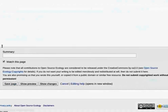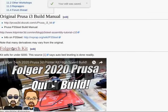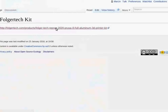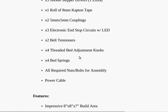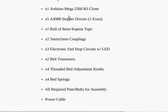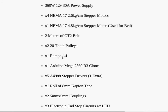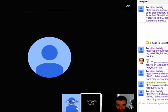So is it a requirement, or is this automatically taken care of, that you don't need to reprogram the firmware? I'm not familiar with the tool chains enough. There's the program on the printer itself, and that's what you need to change, but also things like configuration files. There is a configuration file for the firmware, and then there are different configuration files for slicing. So you would need to change the firmware configuration, but you can keep all your G-code and stuff.